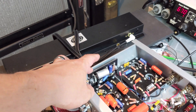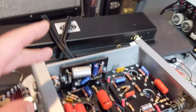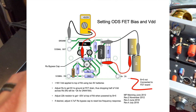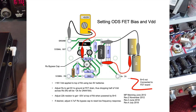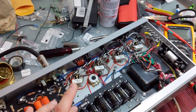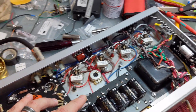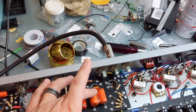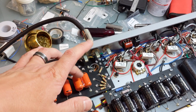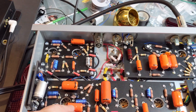I'm going to post on screen the instructions borrowed from the Amp Garage forums on how to bias your FET outside of the amp — that will make things a lot easier. You might also notice there's some hot melt glue between the capacitors now as a final touch. I put that in to make the capacitors more rigid, and anywhere there's an opportunity to stiffen up the orange drops, I did.